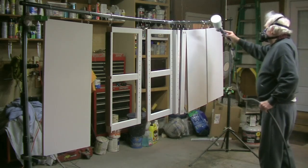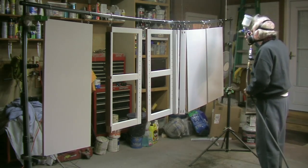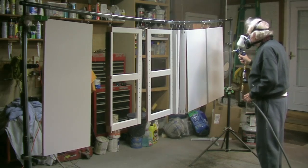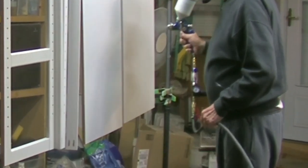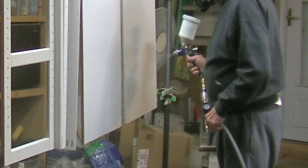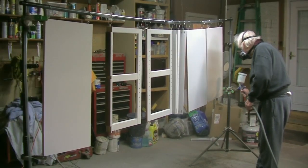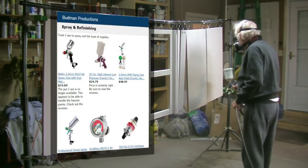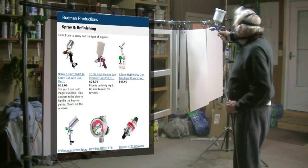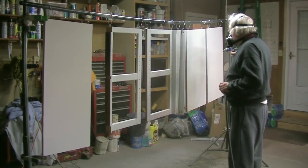In conclusion, if you are spraying a vertical surface, make sure you spray a tack coat first and allow it to dry before applying your first full wet coat. At 40 seconds, I had to narrow the fan just a bit, and remember, I am using a gun with a two millimeter needle, fluid and air cap combination. You may have noticed that I hung not only a regulator, but also a moisture filter on the end of my air hose — in my opinion, it makes the gun way too heavy. I'll address the issue in another video. There are currently four guns listed on my Amazon store with two millimeter tips that cost less than $50, so go check it out at budmanproductions.com. And if you care to do some of your own experimenting, I've added a number four Ford cup.